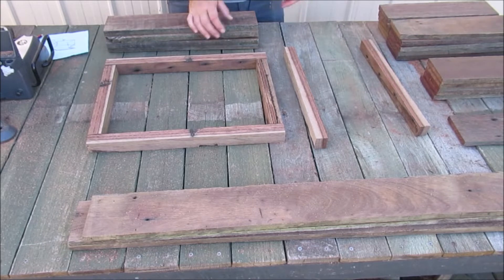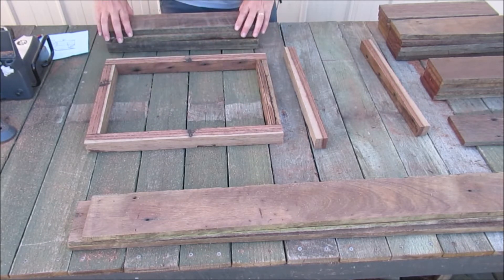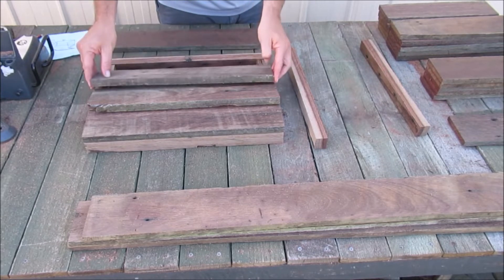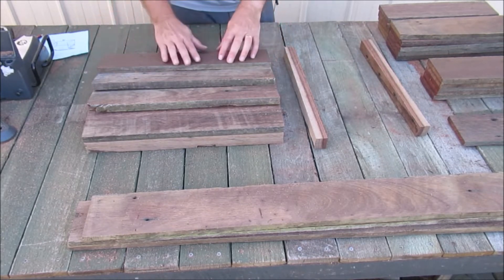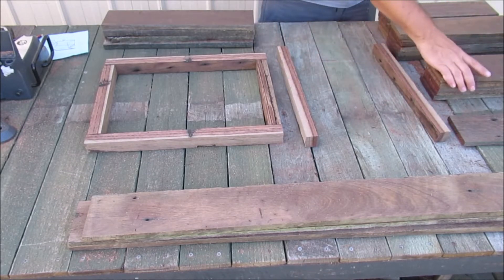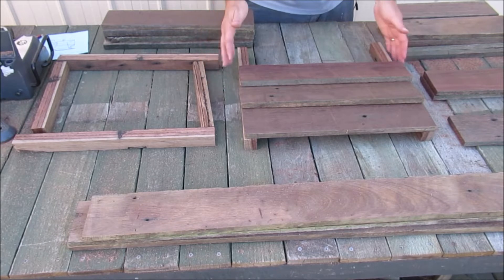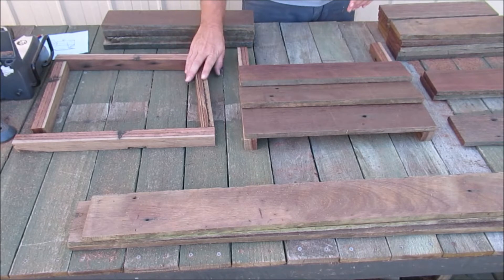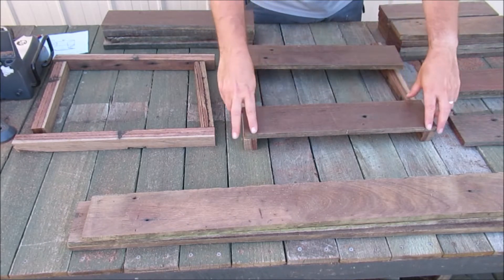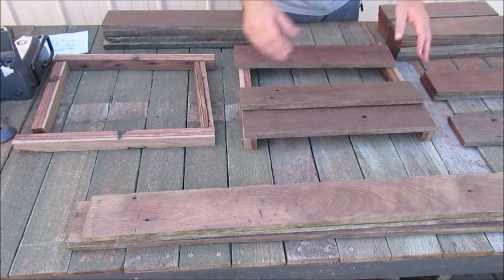We have most of our timber cut to size now. This is going to be the front frame — I'm looking at making this panel removable. That's the bottom piece, we'll just overlap them a little bit and screw these all together so the rain will run off it. The back panel will go on here and then we'll join the sides across. Really simple, basic construction — the bottom one goes flat but everything else is raised a little bit to help water run off.